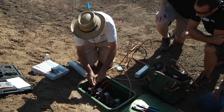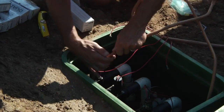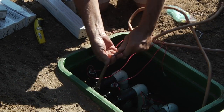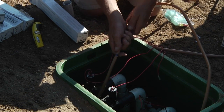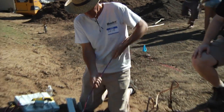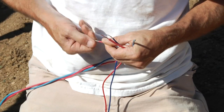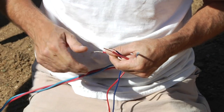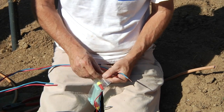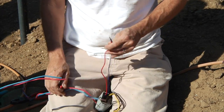The jacket is pretty easy to strip with a razor knife — don't cut through it, just score around it, make a little scratch and bend it till it breaks. It'll snap. We didn't touch a single inner conductor, which is a big no-no in two-wire systems. We've got the jacket off — we'll cut as much slack as we want for the first decoder, leave a little bit to reach the second decoder, and then this two-wire path will continue on back to the next valve box.